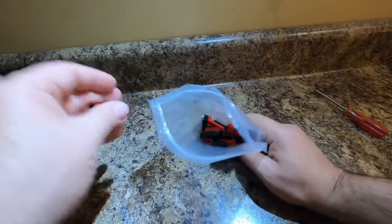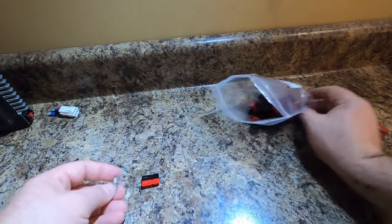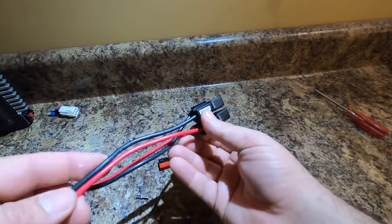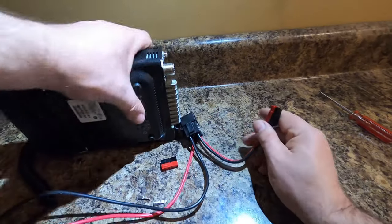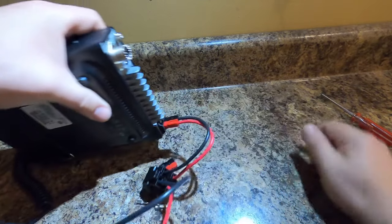We are going to make one more power pole. These are already put together, which is really nice — you don't have to figure out what orientation to put these in. These are bonded together, so they will not come apart, which is also a really nice feature of this particular kit. On one side of the power wires that came from Yaesu with fuses, I had already installed one power pole connector. That might be the one that you connect to the radio back here. Boom — you're there.